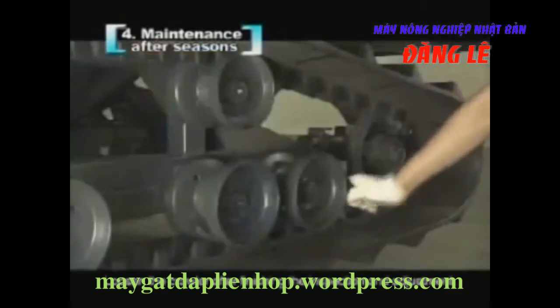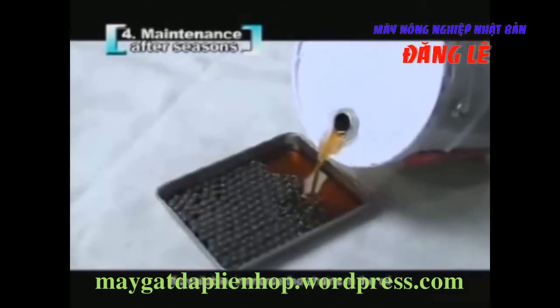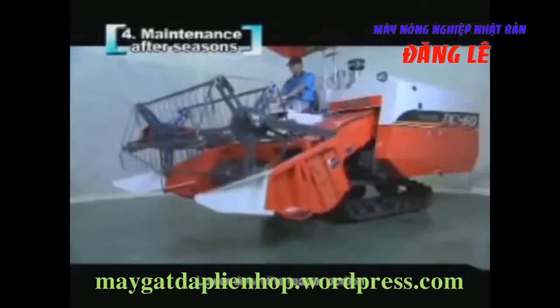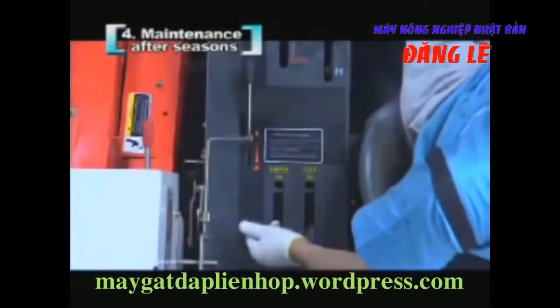Loosen the crawler after finishing the inspection and adjustment. Loosen all the belts and chains of the reaper portion and threshing portion. If available, immerse the chains in oil, which can extend the life of the chains. Lower down the reaper portion after putting every operating lever in the position of off. Remove the key.